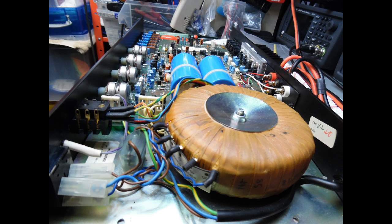Once that was all done and the amplifier powered up fine, the next thing to do is set up the bias on the output transistors — the IQ. For the A60 this is a little elaborate: you remove the 3.15A fast blow fuses from the power supply and connect in a 15-ohm 5-watt resistor. You measure the voltage across it — from startup it should read about 500 to 600 millivolts. Using the two preset potentiometers RV2 and RV102, you make a slight adjustment, increasing it by about 0.2V, and leave the amplifier running. The target is 1.4 to 1.6 volts, and it must not exceed 2 volts.